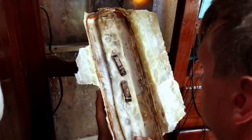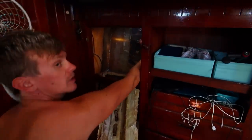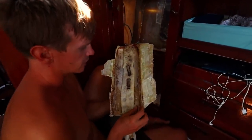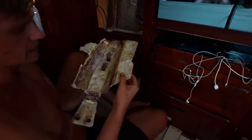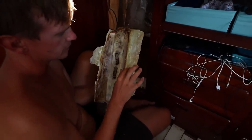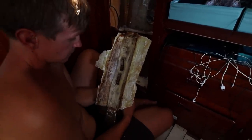There's nothing behind it. Normally this would be made of plywood — you'd lay up plywood and build up a big thick knee bonded to the hull, then shape fiberglass over it. But what the previous owner has obviously done is just kept the fiberglass shell that was there originally, maybe added some sort of backing plate, and then fiberglassed that back to the hull with what looks like maybe three layers of cloth — which is obviously not adhered very well at all and isn't properly wetted out in most places.